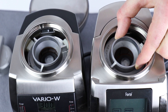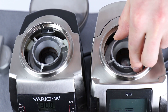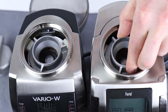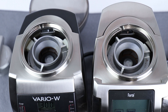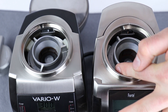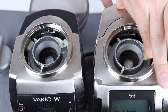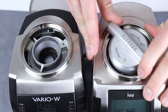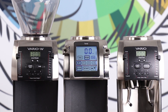If you try to screw it in at an angle it may damage the threads, so rotate it first clockwise until it sits down nice and flat, then go counterclockwise to start screwing it in. As soon as the burr starts screwing in you can see it's begun to thread — it goes about a full turn before it's fully tight. Take the burr removal tool and give it a little extra to lock it fully counterclockwise into position. As the lower burr rotates counterclockwise when grinding, it will not loosen the upper burr — it will remain tight.